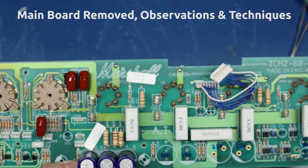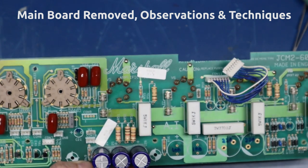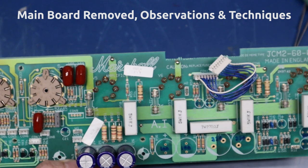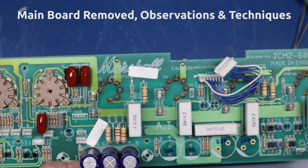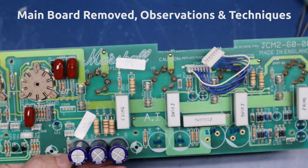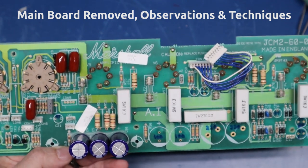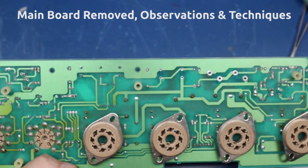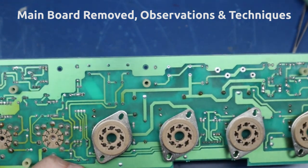So that's what we're going to do - we're going to recap this board. The work was really around removing the caps and cleaning up the flux that was left on the board, both top and bottom. There's really no incremental labor to recap the board; I just have to wait on the capacitors to show up. I've already removed all the old caps and cleaned the holes. Not always called for, and a little drastic in this case. But this one was more problematic because of the work previously done. If this board had no previous rework, I probably would have replaced just these four filter caps and moved on. The board is now prepped - holes cleaned, flux cleaned, ready for new caps.